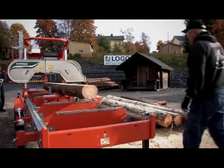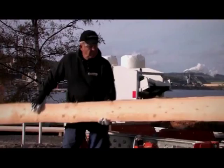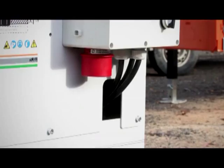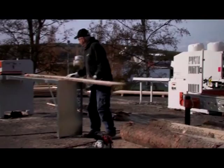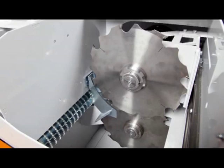When edging in a separate machine, you can take care of the boards that come from the outer parts of the log in a more rational way. By limiting the cutting height, the circular saw blades and the motors that are used can be smaller. This gives low operating current, which can be of great importance if you run your sawmill on the same fuse.